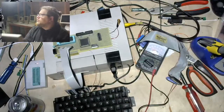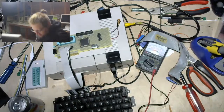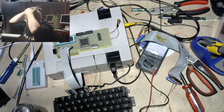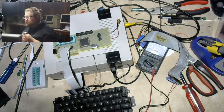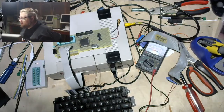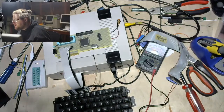So, last time we tuned in, let's go to the old overhead. We rewired this thing. It was previously in AT mode, which was not the right call. It's from the PS2 era and has PS2 mode, which is the more common one. If you ever look up how to program for a PC floppy disk drive, they pretty much tell you about the registers in this version of the chip. The AT mode only exposes registers that are available in the PC AT, which really hampers us a lot. For instance, I have no idea how you'd turn on the drive motors, because that's in a register that is not exposed in AT mode. So we swapped it from AT mode to PS2 mode. It seems to still be working. We haven't really checked the new registers, but hopefully we will do that today.